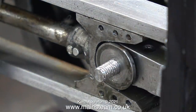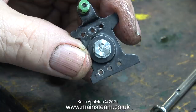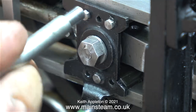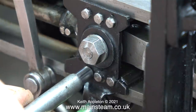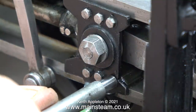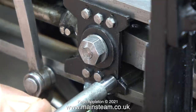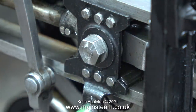Time now to fit the new pin into the crosshead. There's a washer that has to go on it, and here it is fitted, ready to receive the front part of the crosshead. I turned down a 2BA nut just to thin it out to make it look better. Using a 2BA washer, I placed the pin back in the chuck and, using a spanner on the nut, tightened it into place on the crosshead pin. This front plate, complete with the pin, now has to be bolted in position to the main crosshead using six 8BA hexagon bolts. I fitted new ones because the heads were a bit marked on the old ones, and no two were the same size. You have to be really careful, because if you put too much pressure on these small 8BA bolts they will shear off, and that is a problem.